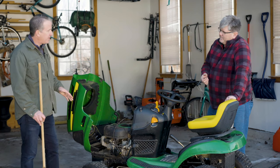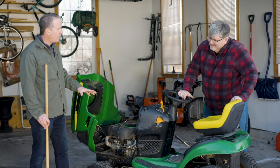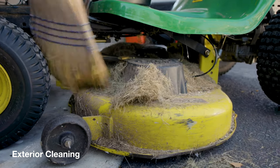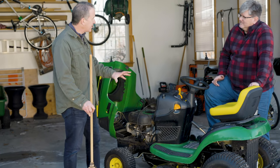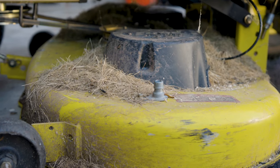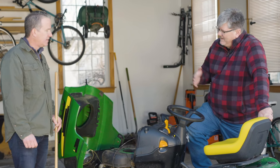One of the other things I like to take care of is to clean the mower before I get it out. Ideally you would have done that before you put it in for the season, but there's still a lot of grass on this. You want to clean off the decking and check the paint around the mower — make sure you don't have any areas of rust. On this deck, like on a lot of mowers, you have a hose port so you can connect a hose and clean the under-decking as well. Keeping it clean and touching up the paint will help it last longer.